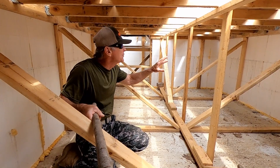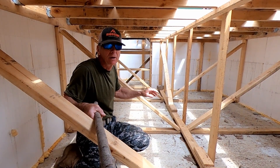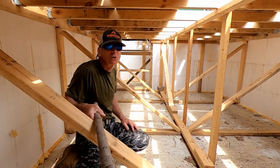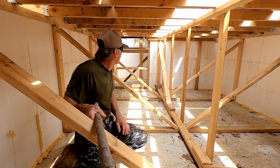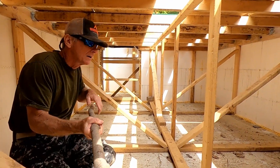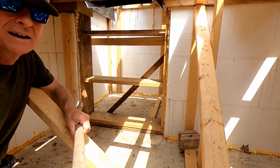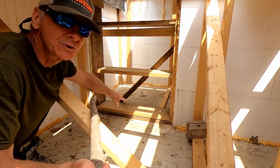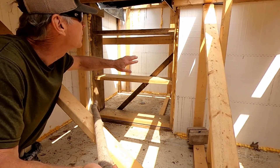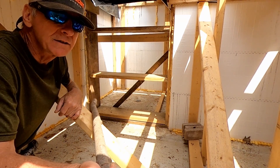So to review, all this wood decking has to be raised up to a specific height, and I'll probably triple the amount of vertical supports — that will be sufficient to hold the concrete up on top. As you can see, the wood frame over here in the doorway is the door buck. This wood frame is built to the specification of the actual door that's going to go in there. So once all the concrete is poured, this wooden structure will be removed and then the door will be able to fit in there.